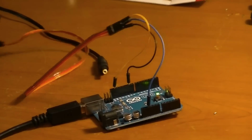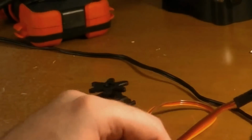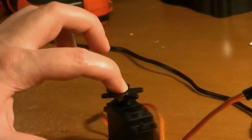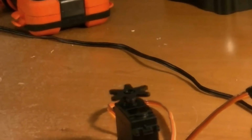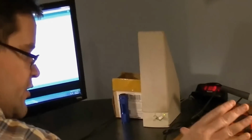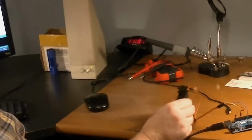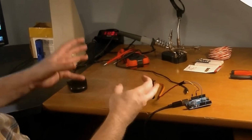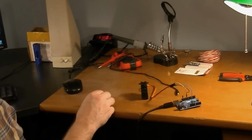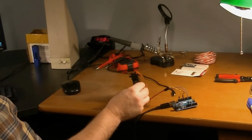Okay, now, alright, you can see the servo is turning, and it's not supposed to be turning. Why? So this is what we have to do now. And this is one of the things with these cheap servos. I think it probably has something to do with the servos, or we're using 5% resistors. So it's also probably like a disparity in the resistors, an imbalance. If you use like the 0.1% resistors, this might not happen.